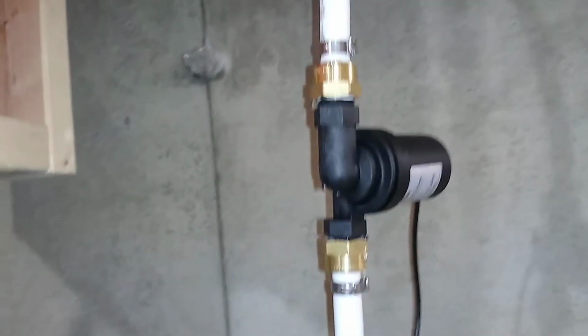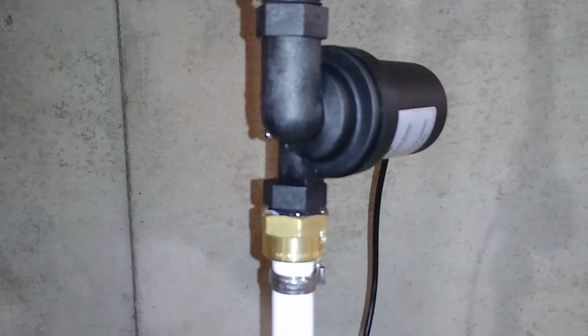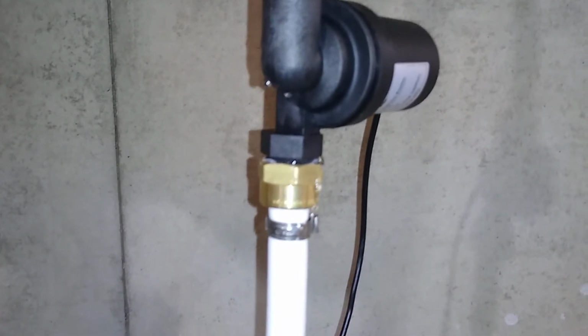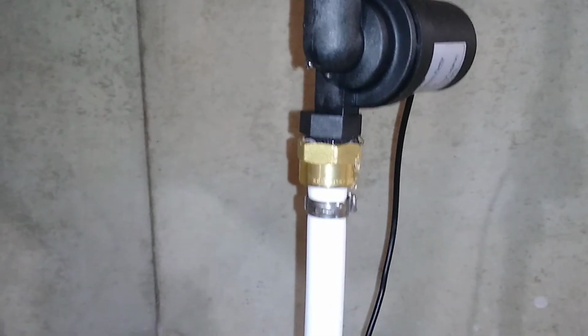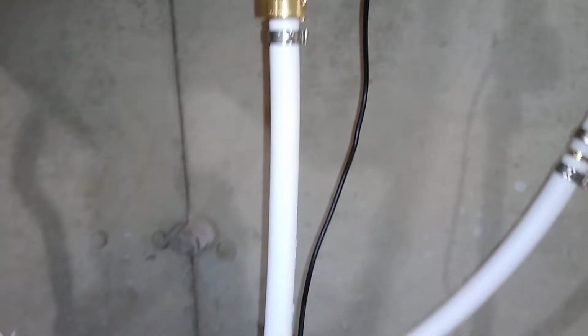And off of the cold leg, this line comes in, goes to the heat exchanger, comes down to the pump. This little DC pump is leaking at these fittings. I think these might be straight thread pipe or plastic fittings that go into the taper thread brass fitting. So I bought some sealant to hopefully seal that instead of Teflon tape, something that will actually cure and seal.